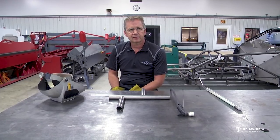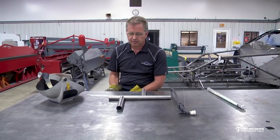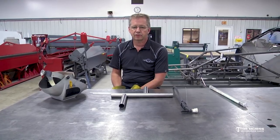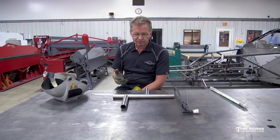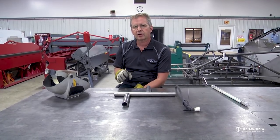So what I'm gonna do tonight is some titanium. You guys may not have much experience with titanium, you may be a little bit afraid of how to weld it or how to process it. And it is different. It's similar to 4130 and stainless, but it's totally different. Your settings on your welder are gonna be the same. You're gonna weld it on DC. Your temperature settings are gonna be about the same for the wall thickness on 4130. Tacking is gonna be the same. The weld process is a little different and the post flow on the argon is going to be different too.